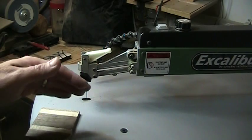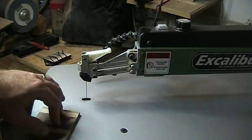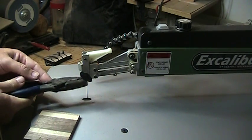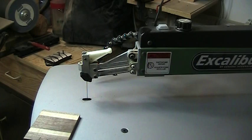If you have a longer piece and you need more depth in your saw, all you really need to do is change the way your saw cuts, and it's easily done with a pair of pliers. Just take your blade at the top, give it a twist, and the same at the bottom of the blade, give it a twist.